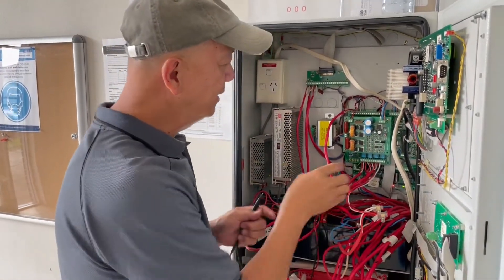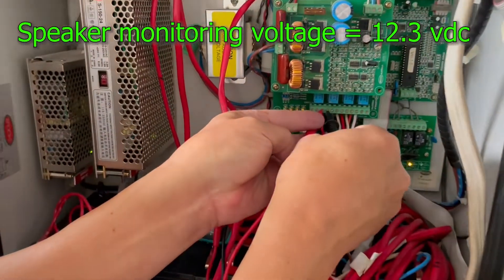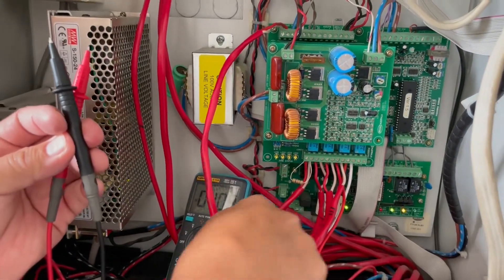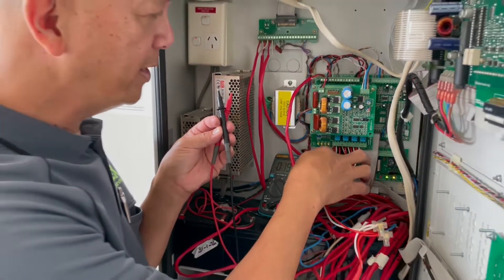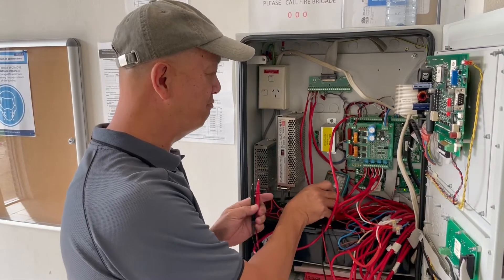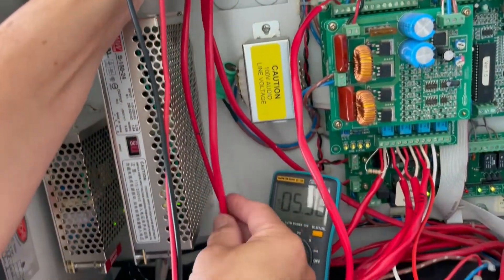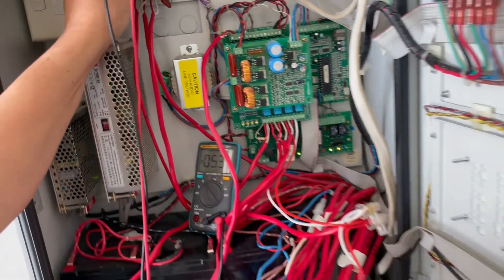This is the speaker line. The power for the speaker line is 12.33 volts. This panel has one loop in for the speaker and these are all supervisory speaker lines — that means one in and then four out. Now we have another cable which I am not aware of what it is. There's no power on that cable, so let's test the system to find out what that cable is.